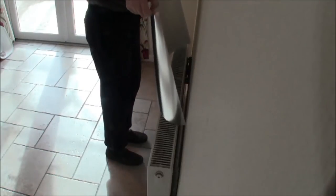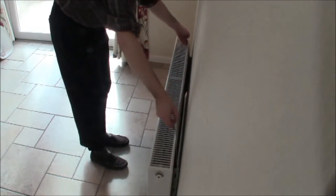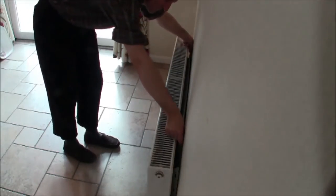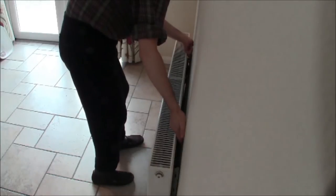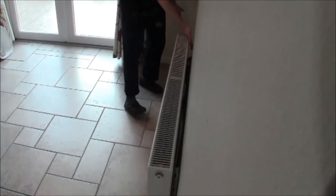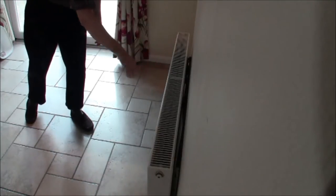Once you've got a good even coverage you're ready to apply it to the wall. Now this is the tricky bit. This job will admittedly be a little bit fiddly, but thankfully the wallpaper paste itself is water-soluble. You can get it smeared over anything you don't want it on — like a piece of the wall — and then just wipe it off with a damp cloth. Put it fairly low so it doesn't offend the eye line; remember you have to live with it. If you don't like the look of the foil, put it as far down as possible and then gently squeeze it in with your fingers. The wallpaper paste will grab the wall pretty quickly and won't dry instantly, allowing you the opportunity to make sure it's all level — the level you want really is level to the top of the radiator.